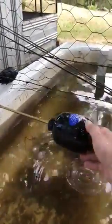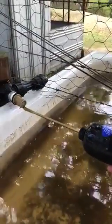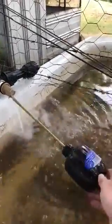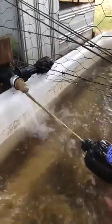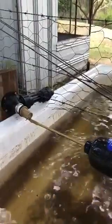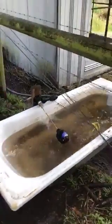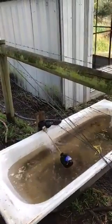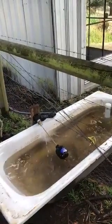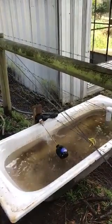What happens is when the water drops — from animals drinking it, sprinklers activating, or whatever it may be — the water source is replenished. As the float goes down with the water level, the water turns on, and as the float rises when the water level gets up to where it's designated to be, it shuts off again. This allows wonderful automation, whether it be watering plants or filling up troughs for animals, so owners don't have to come out and check or fill them up manually.